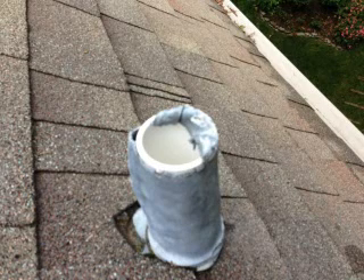If you're watching this, you've probably had an issue with squirrels getting on the roof and chewing the lead that surrounds the vent pipes coming through the roof. These vent pipes come from the toilet or your sinks inside the house, and once the squirrels chew the lead around the top edge to sharpen their teeth, rain water will leak in between the PVC pipe and the lead flashing and cause you some serious issues.